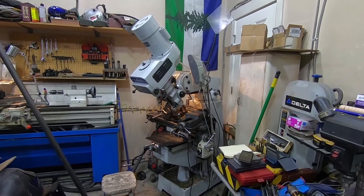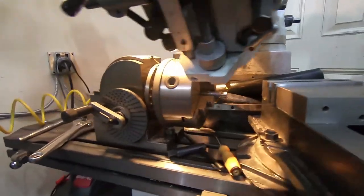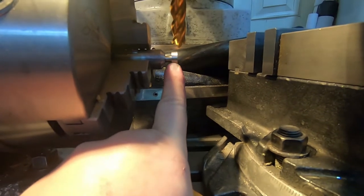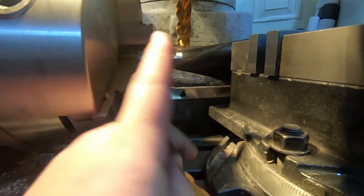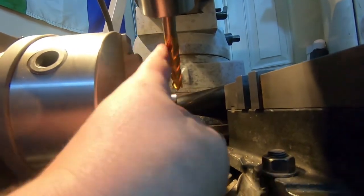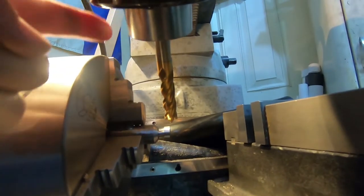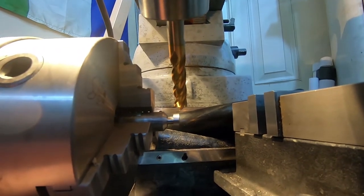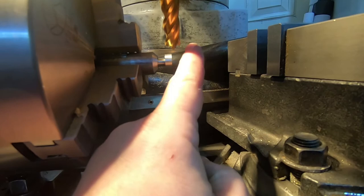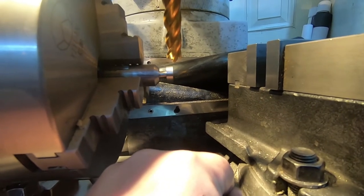This is what I have set up. I've tilted the head on the mill over 45 degrees, and if you look down here on the table, I have the indexing head set up. There's one of the bolts I just made, screwed into a simple mandrel to move it out from the head enough to give clearance. It needs to be that long, otherwise the quill will start to interfere with the indexing head. So it's centered in Y, then I'll raise the table up and just move back and forth a little bit in X and cut a nice V-slot in the head of the bolt. That'll be much nicer knurling than I can do on the lathe.